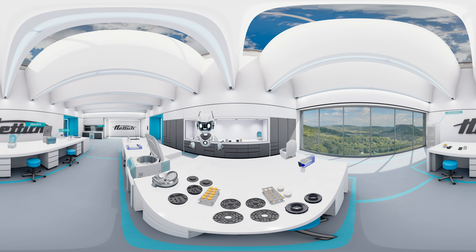Different and broadly used vials and containers can be used with the Zentramix. Most important are two milliliter twist top vials, 15 milliliter and 50 milliliter tubes, 10 milliliter injection vials, and 150 gram and 200 gram plastic beakers like creme jars. Different types of vials and other sample containers can be fixed to the rotation units of the Zentramix rotor by using specific sample adapters. These adapters can easily be put into the Zentramix rotor.